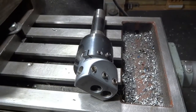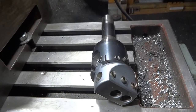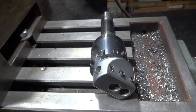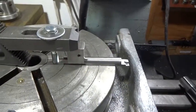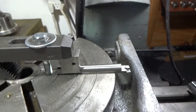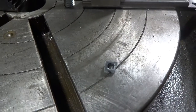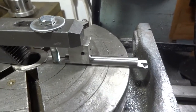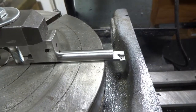I'd like to use this boring head to bore the outside of a round part rather than the inside, and to do that I need a left-handed boring bar. I've decided to make that out of a four-inch long piece of drill rod with a diameter of a half inch. I have a very small carbide insert that I'm going to use for this — the method I'm using is not high-tech, but I've used it twice and it's worked quite well.